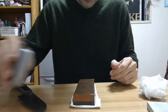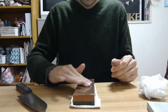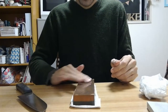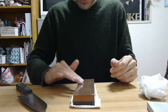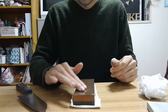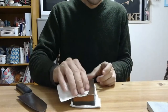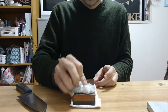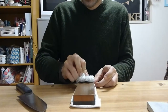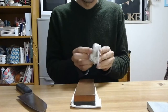When you're done with your oil stone, add a little bit more oil — though I've got a lot here, more than I need. Then just rub the stone until all the metal particles come up — all that gray mud — and just wipe it down or pat it down so it's nice and fresh and ready to cut the next time you need it.